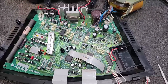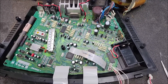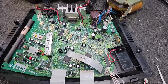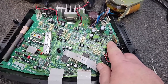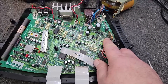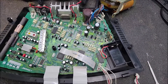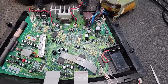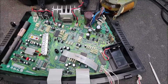But I did replace it, and everything is working — the 10-volt is where it's supposed to be, the volume is doing its thing, everything seems to be good. Another thing: when I was looking at this 10-volt regulator on the input side, which should be around 14-15 volts or so, the input side had a huge sawtooth on it, which is a further indication that there was a heavy load. I hung a scope leg on it and there was probably a 4- or 5-volt peak-to-peak sawtooth — further indication that you've either got a bad cap or an excessive load. So replaced all that.